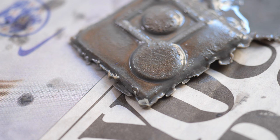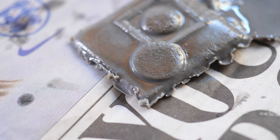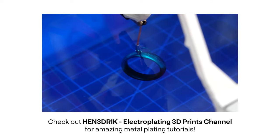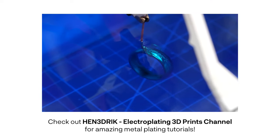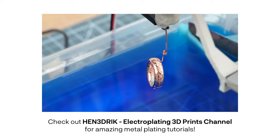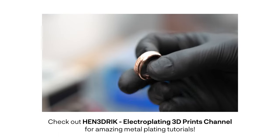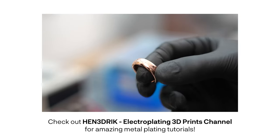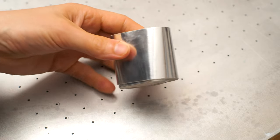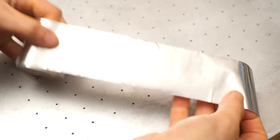At this stage I kind of gave up on easily printing my own 3D resin stamps, but I had one last idea — to coat the outer layer of the resin stamp in a conductive material. You could try to galvanize the 3D print, but I was unsure how clean a surface I'd achieve with that process, and it seems quite involved and complicated. At that point I might as well just CNC machine the stamp itself. A quicker solution I thought of was to use some aluminium tape I had sitting around.